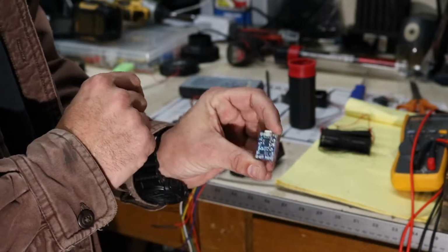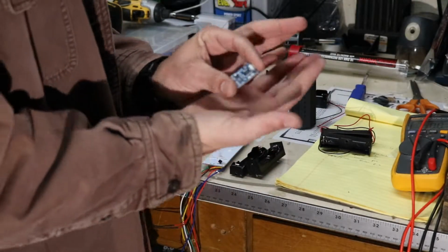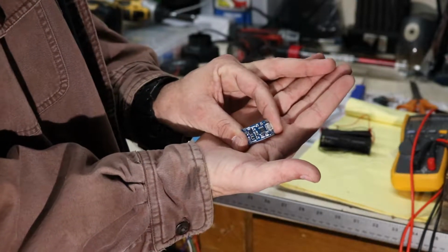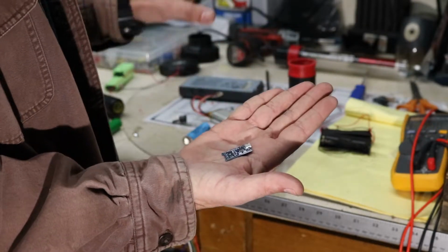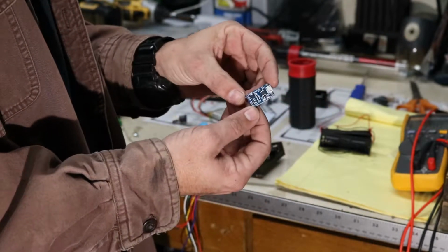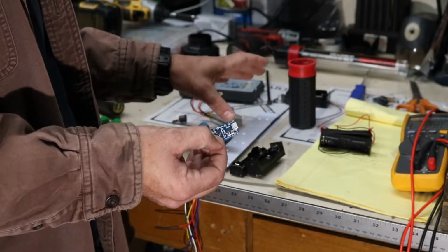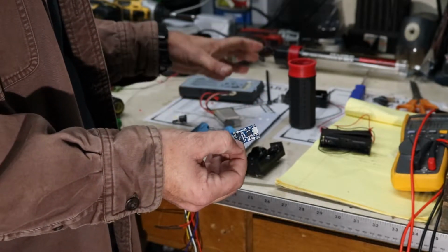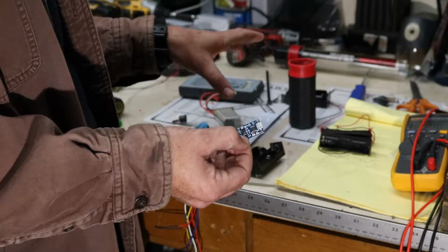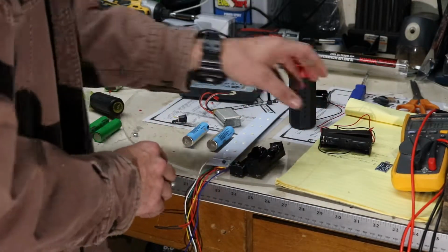So this little board is going to take care of both of those for us. It's going to handle our charging, and it's going to handle our protection for low voltage cutout, as well as over amperage. This little board here is rated at 1 amp per board. We're going to use 2 of these boards because they're single channel, and that fits in perfectly for what our batteries can be discharged at, which is about 1.5 amps. So our batteries will be higher capability than this charging board will put out. But this little LED strip here is probably only going to draw about 3/4, maybe 1/2 amp at max setting, and that's probably giving it credit. It probably draws a lot less than that. So there's our charging circuits.